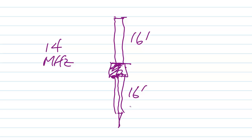Now this is an unbalanced antenna system in a sense. It's also balanced in another sense. So you could use a balun coil here. I'm not sure how much difference it would make. Now you might wonder about antenna currents induced on the coax from this lower section. Will that be a problem?